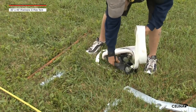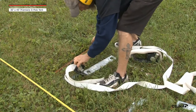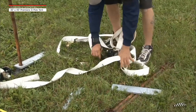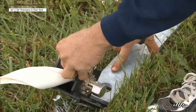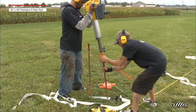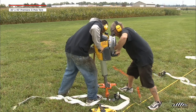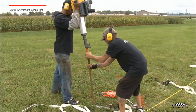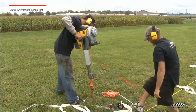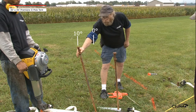The ratchet must be facing in towards the tent. Place the stake plate on top of the box ratchet, aligning the stake holes. Drive the stakes vertically all the way down until the bottom head is flushed with the stake plate. Continue this process until all box ratchets and stake plates are secured. Vertical is defined as straight up and down or an angle away from the tent up to 10 degrees.